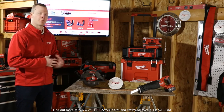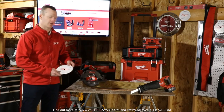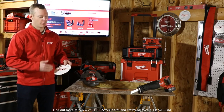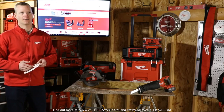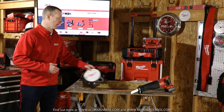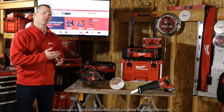It's critical to get the type of blade right for the cut that you need. When thinking about blades, think about tooth count. The higher the tooth count, the more finish ready the cut is going to be. The lower the tooth count, the more rough the cut will be. For general construction, you can go with a lower tooth count — 24 tooth being the more common. But you can go up to 60 or higher for a really fine, clean finished cut.